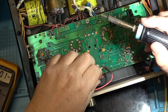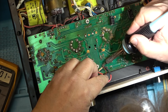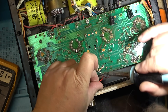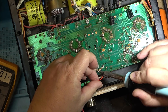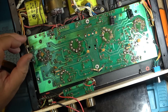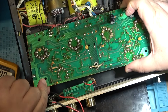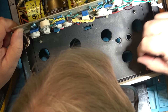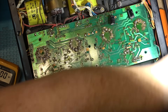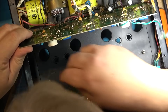I'm going to check some resistors because I think we're going to find an open resistor on this side that's causing the voltages to be way off and causing the tube to really be driven hard — that would certainly shorten the life of these tubes big time. The solder just fell right off. I'm not really impressed with the build quality of this unit — I'm sure it cost a small fortune, and I'm just not that impressed with how it's put together. Unless it was a kit that someone built — but the fellow brought the box with it, so I don't think it was a kit.